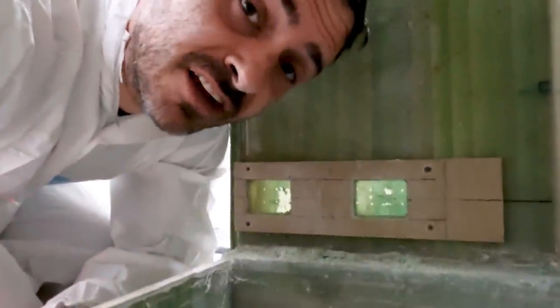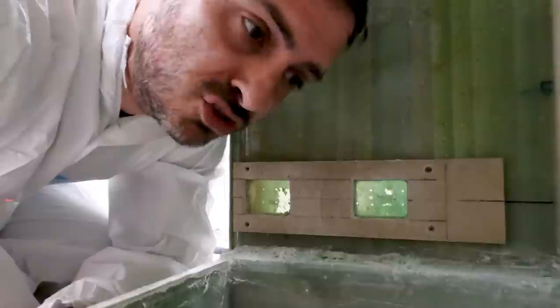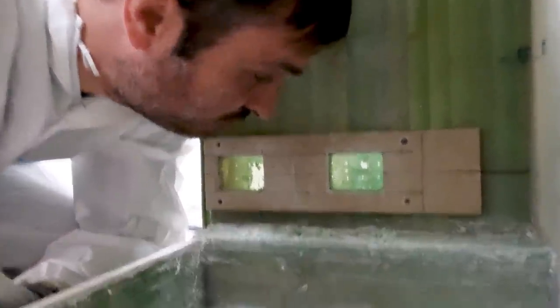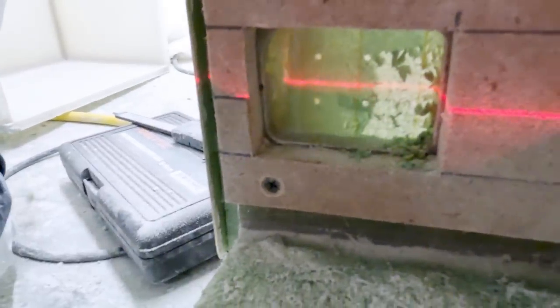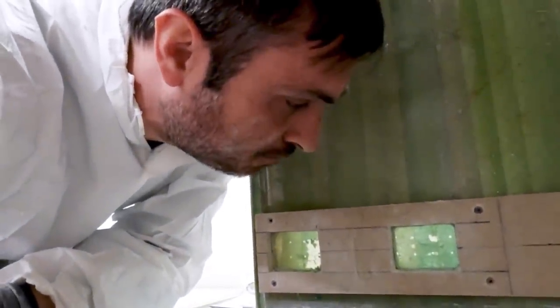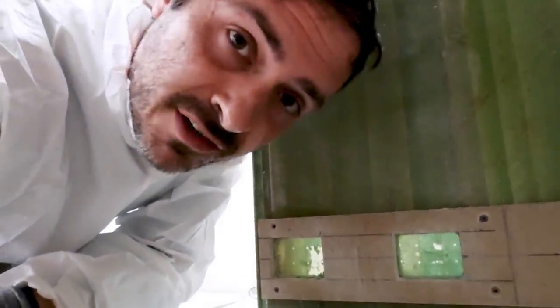The skin that's left is just a 12-ounce or about 450-gram fiberglass, so very very thin — you can actually see the light through it right there. What I've got to do is just get the rest of that foam out to make sure I have a very good surface and I'm bonding to the skin itself. Then we'll repeat this on the other side.